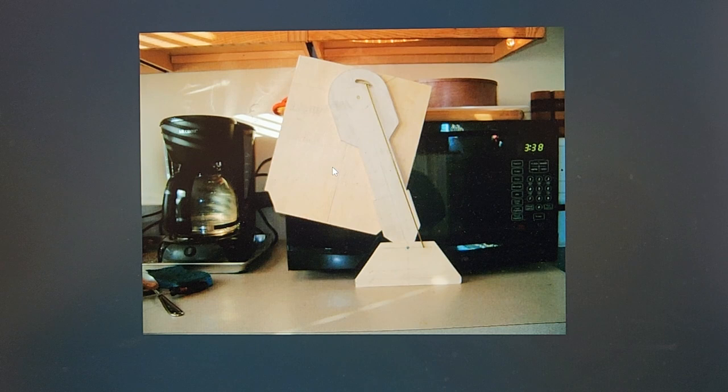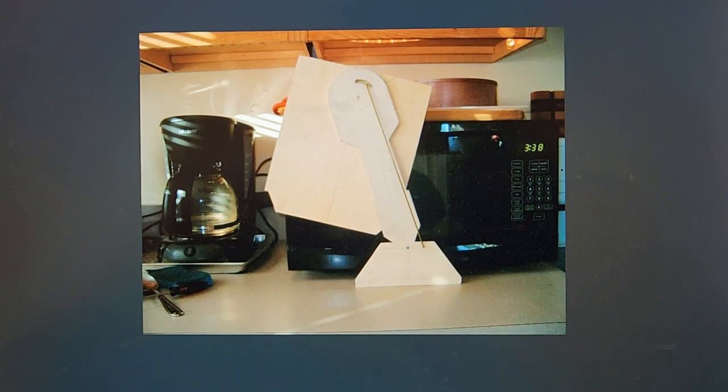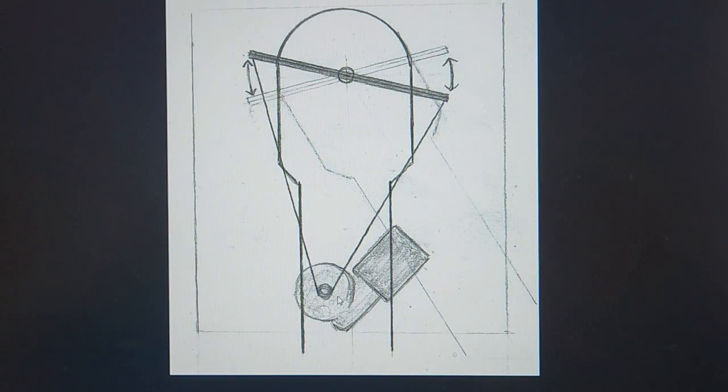I hope that made it simple to understand that aspect of it. We have a lot of builders coming up with some sort of complicated independent motors that linkage to the legs so these ankles can be controlled independently — which to me is extra weight, over-engineering, over-complicating, and causing a more complex failure point. As long as your body-to-leg is transitioning, a simple rod doing the leg-to-foot transitioning is more than enough. We'll move ahead on future videos to get into the meat and potatoes of motors controlling the body and forcing the side legs to go back.